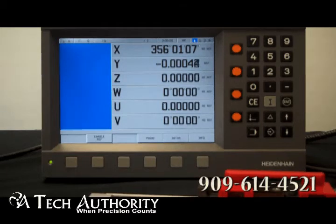You can also attach a probe in the back if you want to use it like a KT edge finder by Heidenhain. For turning, it has one datum, 99 tools, and it also has freezing tool position back-off for oversized allowances.